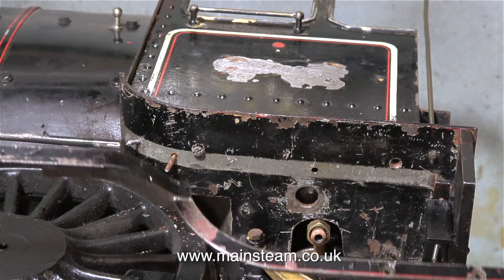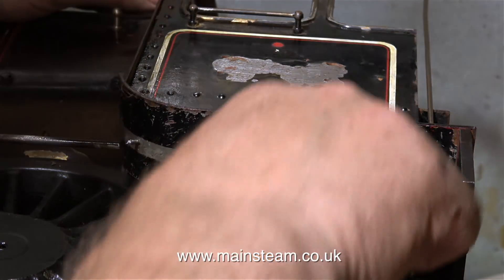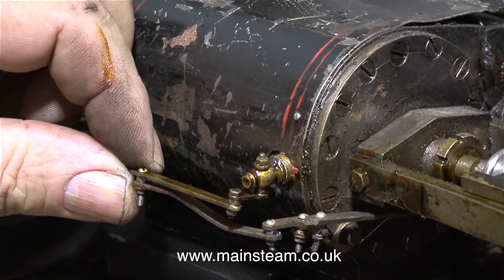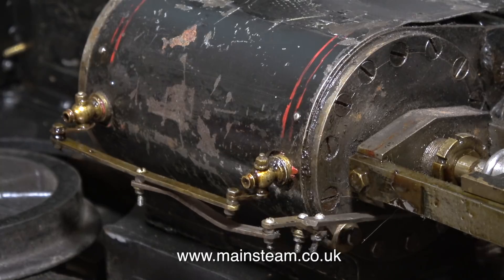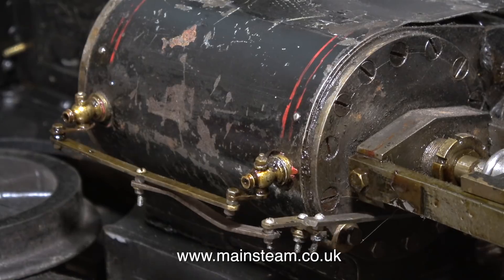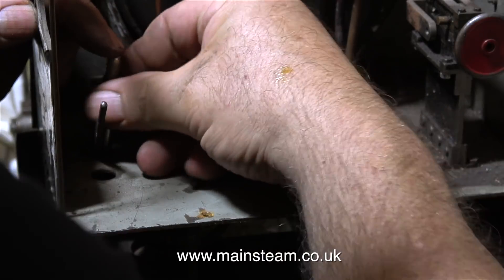I hope that the rest of the parts on this locomotive are made to this standard — it's very good indeed. There are quite a lot of these long bolts to shear off before removing. I'll have a quick look at the cylinders. This is the mechanism that operates the drain cocks, and it seems to work okay. It's a bit on the loose side; I'll probably do something about that. But at least it works. And once again, all the bolts are miles too long — I don't like to see bolts left at this length.